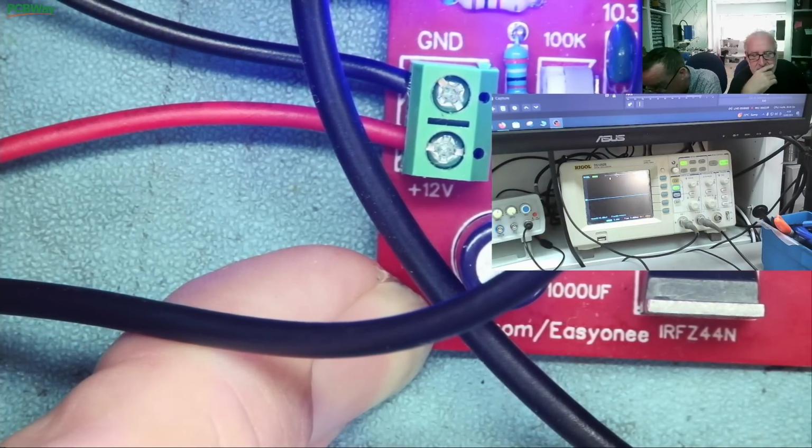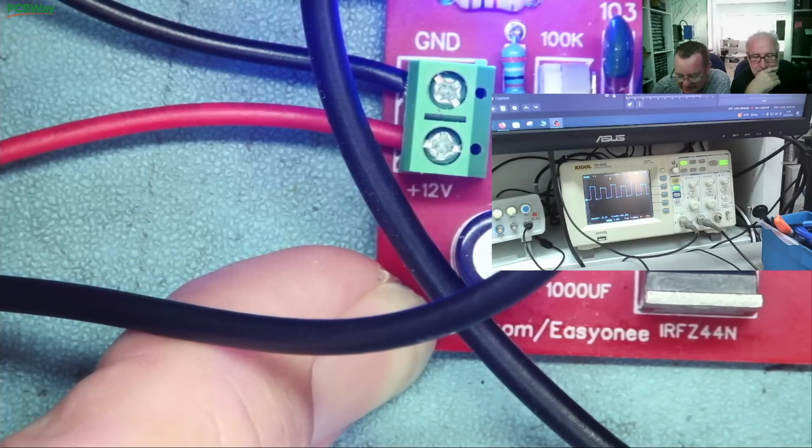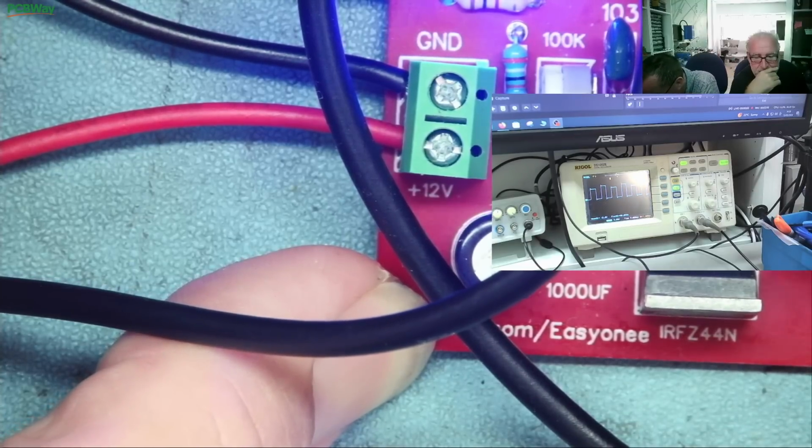Pin 13, there should be... Okay, there's a thing going on. Nice. That is oscillating. It's like every other one's are different. Yeah, and this is probably the same as we saw on 13. So this could be a power supply problem.